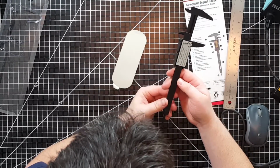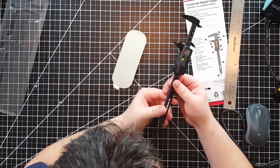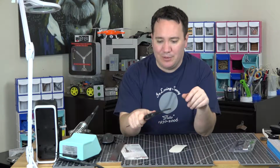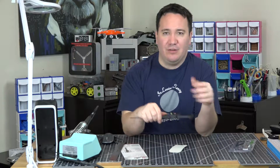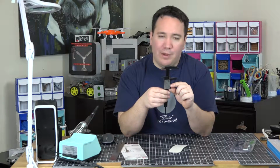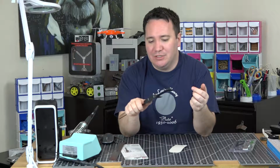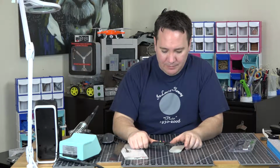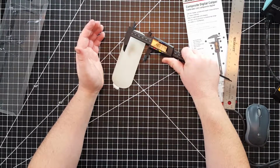Okay, one thing that I'm noticing right now, and I don't like this. There's no wheel on this. Not my first pair of calipers, and my instinct was immediately to put my thumb right here and go like this because I thought there was a wheel there. Some calipers have a little wheel there so you can dial in because you're measuring to 0.1 millimeter accuracy. If your thumb moves too much, you're going to be pushing this thing all around, right? The little wheel lets you dial in very finely. You can still use it as a handle, but I still don't really like it that much.